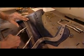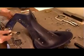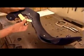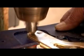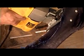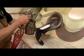To make an English saddle, they attach both rigid and flexible steel strips to a frame made of polyurethane, which is called a tree. Then, they rivet a stirrup bar through the tree to the steel that's just been fastened to the underside. With a jigsaw, a worker cuts a hole in the tree and then glues foam for cushioning.